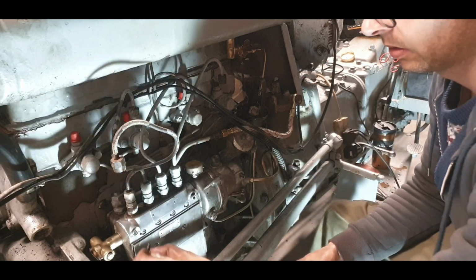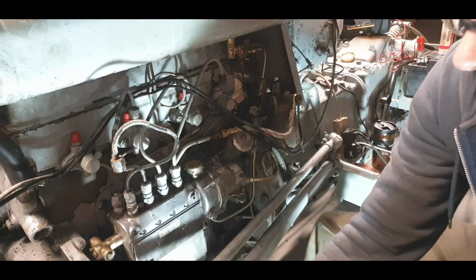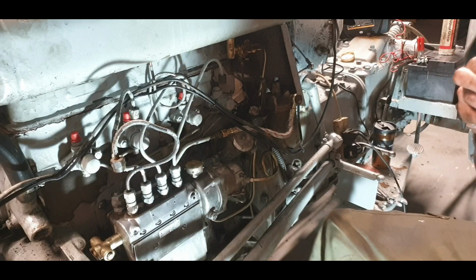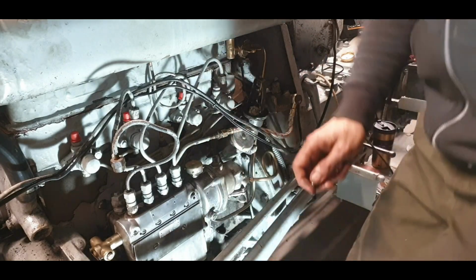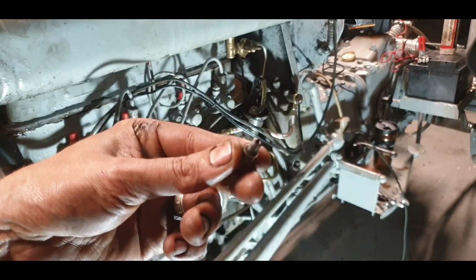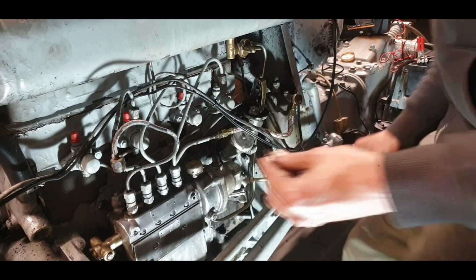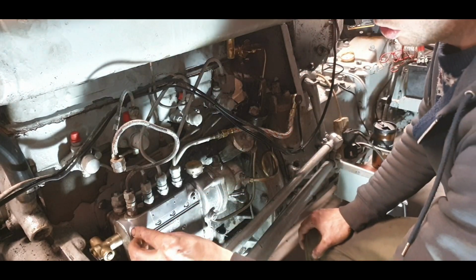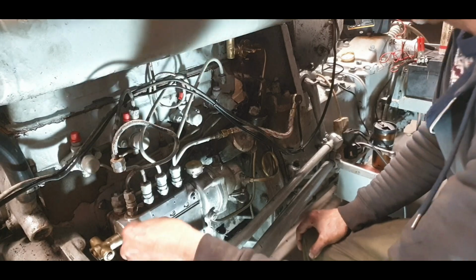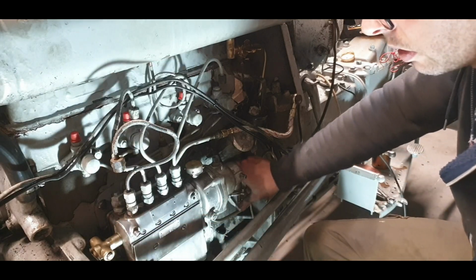Okay. So what I'll do is I'll let that drip. I'll just go and get a seal washer for this bleeder. My God, how that was ever meant to seal, I don't know, but that's good. We're working there anyway. This is a tiny little Dowty washer because it takes so little pressure to seal, and you won't go wringing threads and all of that. So just leave that a little bit loose there and see if we can get some air out of the system.